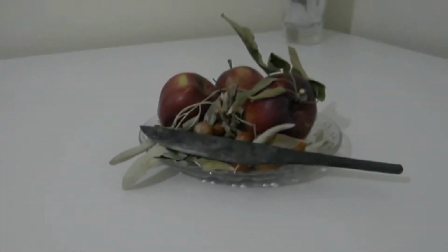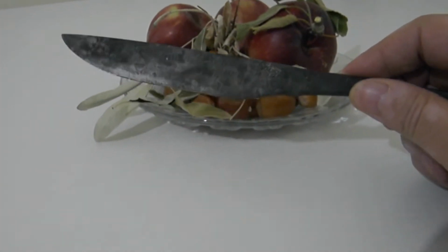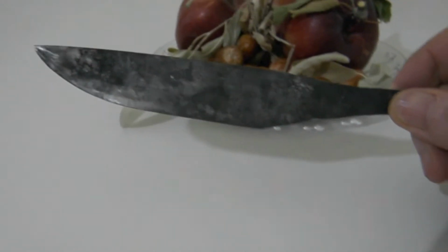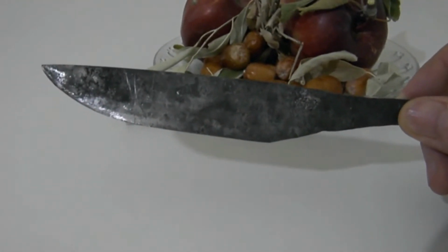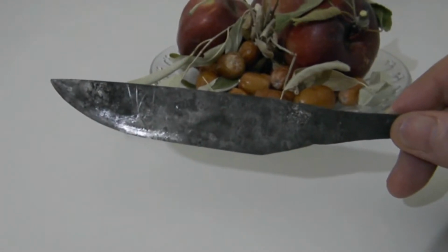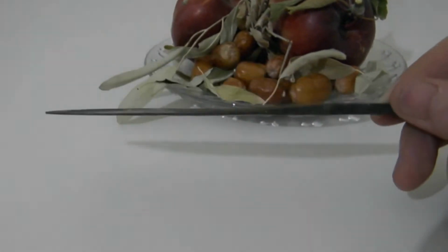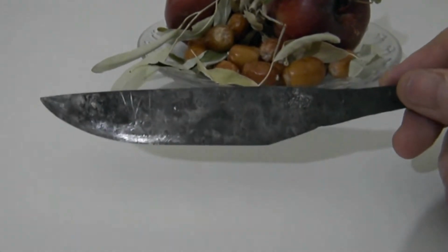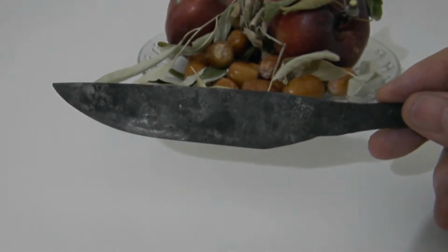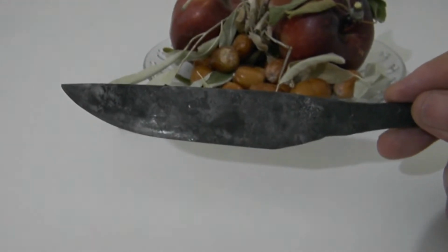I'm so happy. So friends, we reached today the last stage of hardening and tempering of the blade. We scratched it, hardened it, and for tempering I put it in the kitchen oven at 150 degrees Celsius for 1.5 hours, 45 minutes on this side and 45 minutes on this side to make it even. After hardening to minimum 61, it now fell down to about 59 or 58.